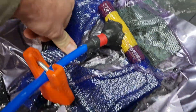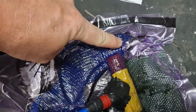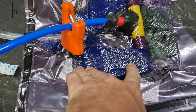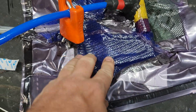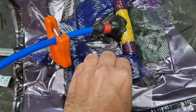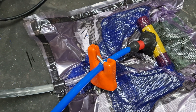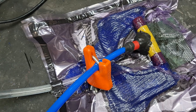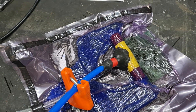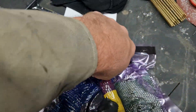I don't think it's going to be amazing — it's got little tight radiuses. On this back section it's a 90-degree, so we all know that's going to be a problem, but it's not safety critical so I'm not stressing about it too much. It's more about getting the part finished. I can see a little raised lip but I'll keep massaging it until I get the corner nice and tight. I put in a lot more hardener than I should on purpose — usually we do a 28 to 29 ratio, I did a 38, so an extra 10 just to get the part to harden quickly.